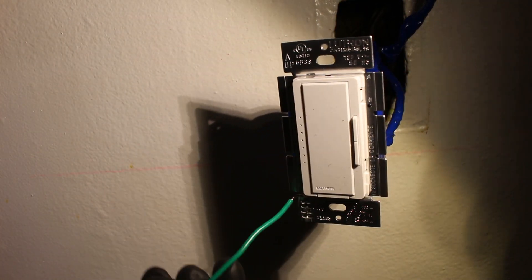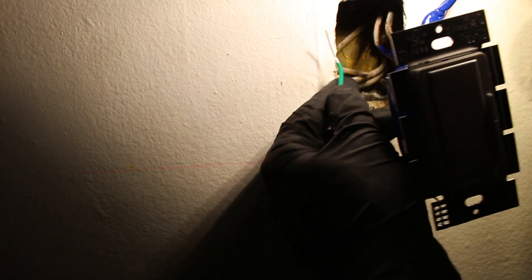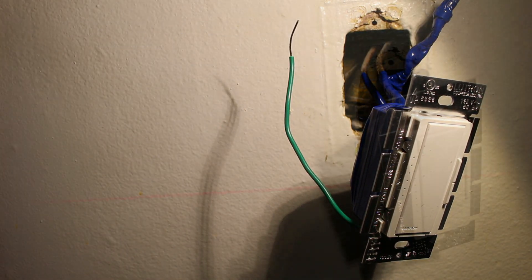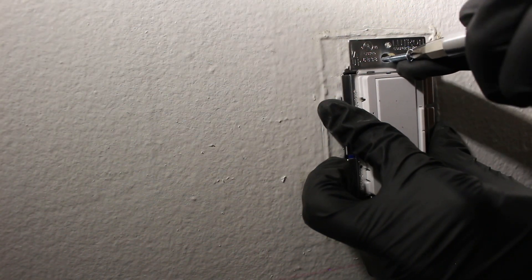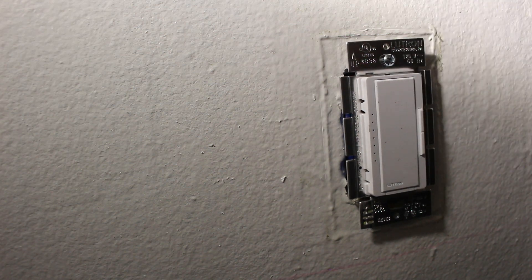The wires are now in much better condition. The original switch didn't have a grounding screw, but it's good practice to ground this — you would connect the ground wire to the metal casing somewhere inside the electrical box using a wire nut. As for the ground wire here, I put a screw into the metal behind the box and mounted it there. From here we're just going to push everything in, put our screws back, beginning with the longer screws. The kit does come with some screws, so we'll get those in.